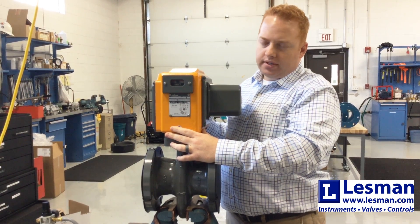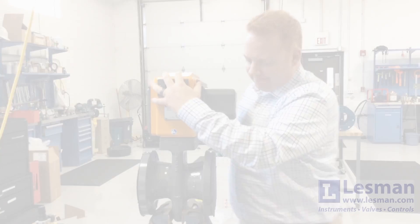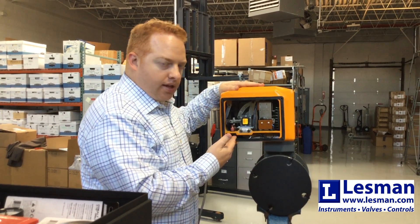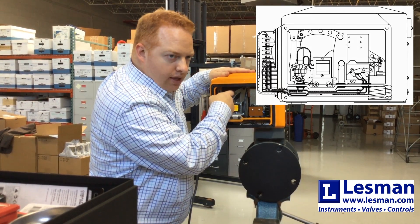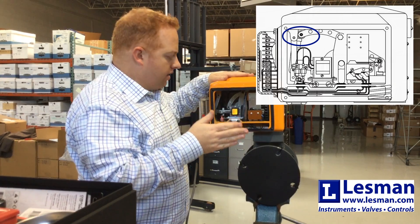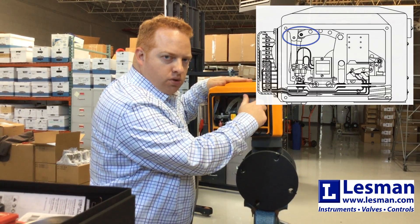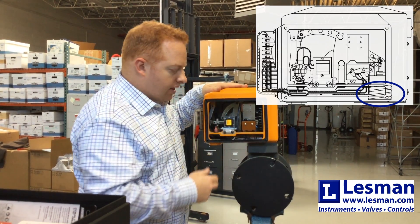Now I'll connect the bolts back up to secure the top assembly onto the valve body, and then open up the side access cover plate to make sure everything is aligned properly. You want to confirm that the roller arm — or rocker arm — which has a little wheel at the end, is sitting at the center of the pedestal. That confirms the valve is aligned properly. If it seems off skew, there may be additional torque on the return spring; in that case, get in with needle-nose pliers and manually give it a little turn to line it up properly.